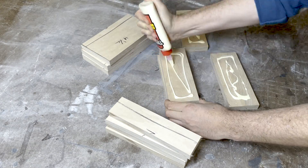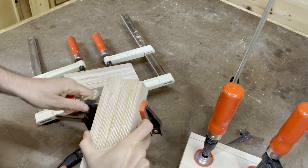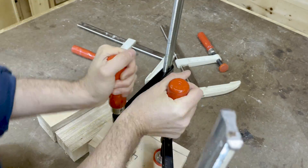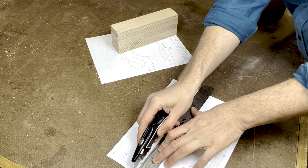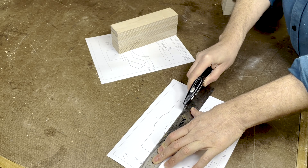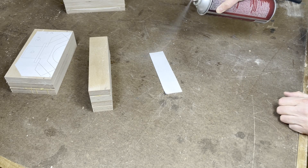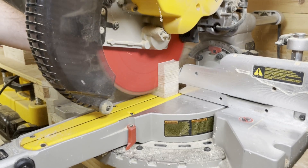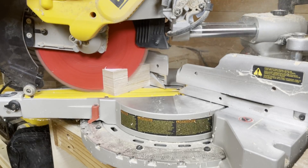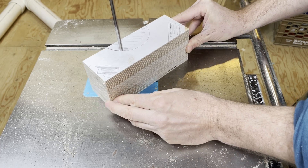There are three parts that need to be cut out of big glued-up blocks of plywood, so I'll slather on a bunch of glue and put on some clamps, wait a little while and take the clamps off. I'll square those up on the table saw and cut out some templates that I printed with the shapes of the blocks on them. Then I'll attach the templates to the blocks with some spray adhesive on both sides. With the templates attached, I'm going to use the chop saw and the table saw wherever I can to get straight, parallel, and perpendicular cuts, and then take it to the band saw to do the rounded and angled parts.